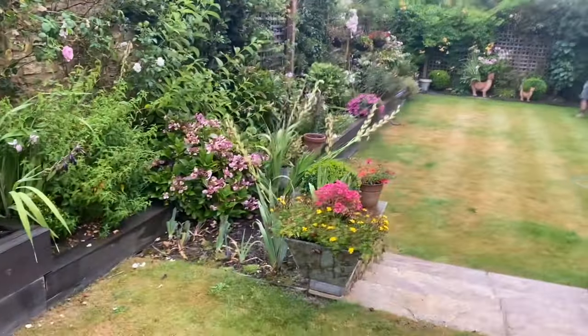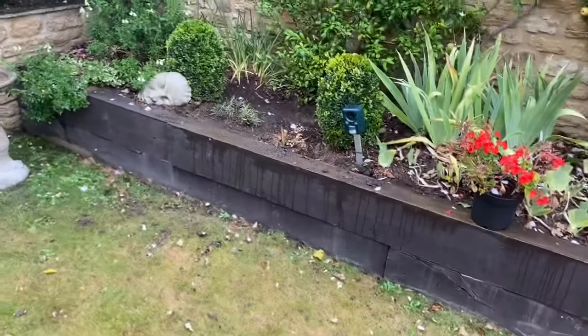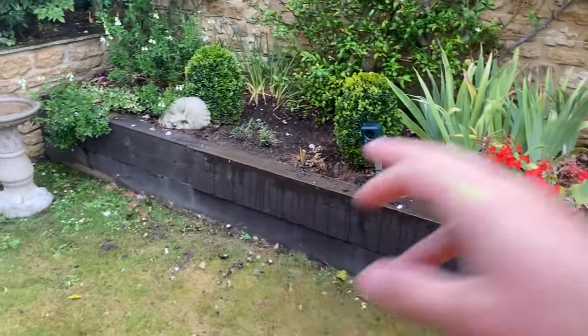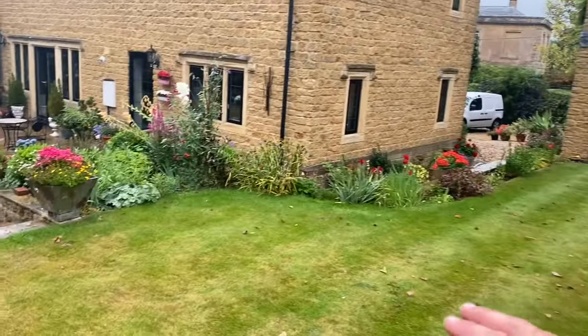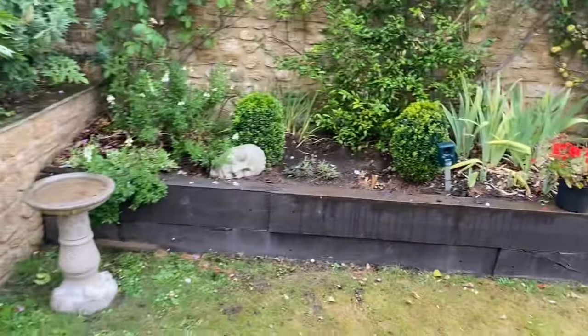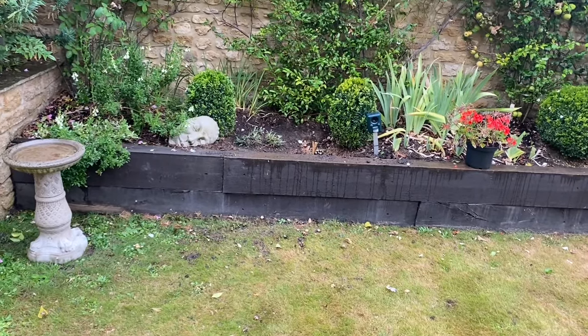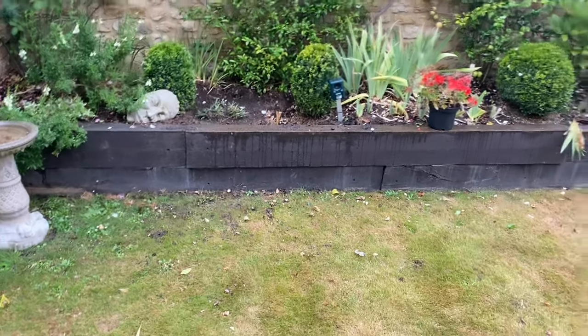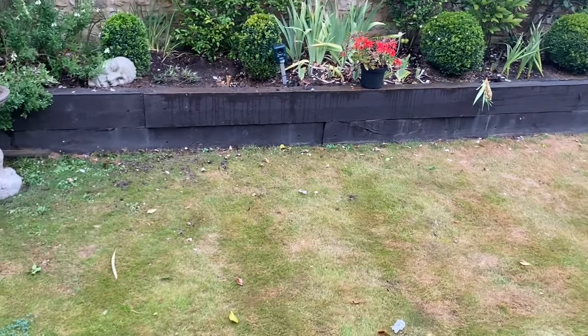But where it's been so dry, hopefully, because now it's raining, the bank doesn't just decide to collapse. So the less we disturb that bank, the better. Just get everything prepped. All the materials are coming today. It's quite a small site, so we need to make sure it's all organized. And yeah, we'll get these sleepers out, get some prepped, and then hopefully, if the materials come at a good time, we'll get a nice footing down.